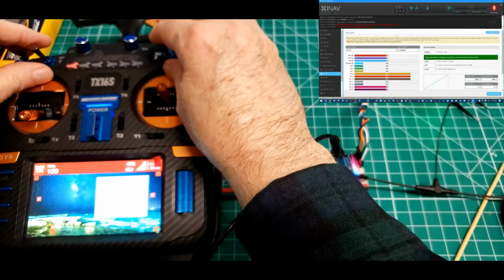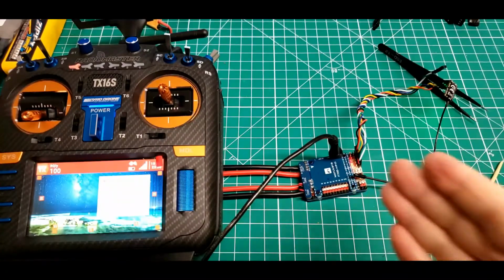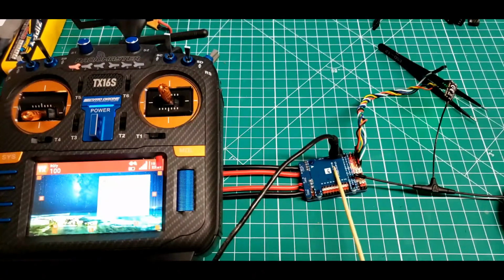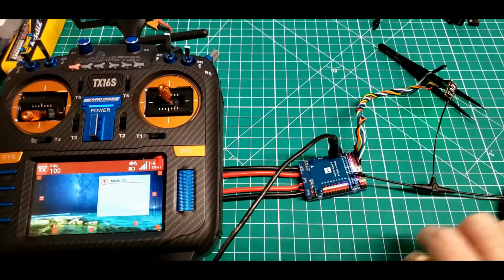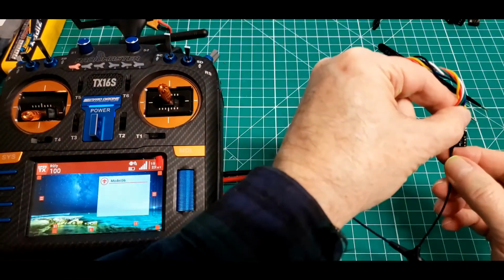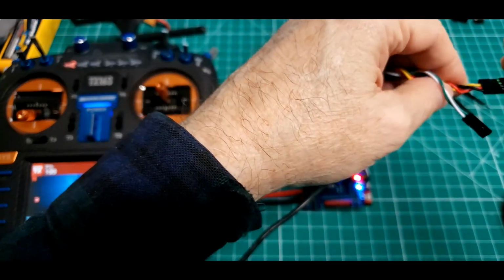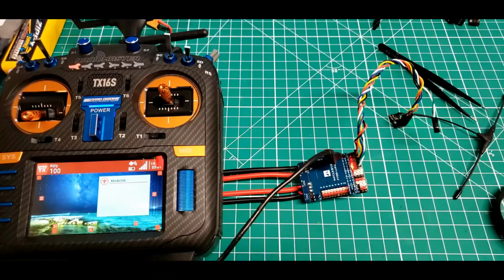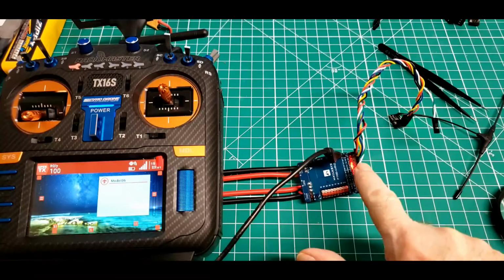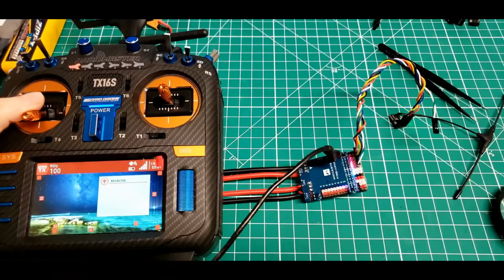And then some of these switches on here, you saw me flipping. So there it is. There's a F765 controller board with a Crossfire Nano RX receiver connected to it, hooked up with 4 pins, ground, voltage, and we're running the CRSF bidirectional protocol on UART 6 of the 765 Wing with very few configurations to INav.